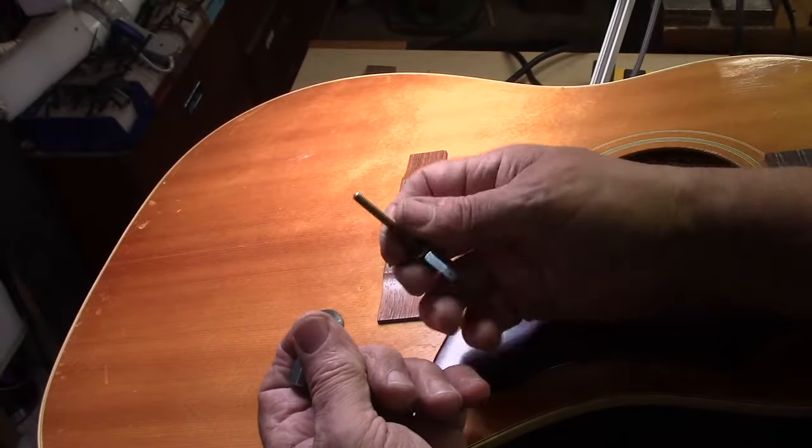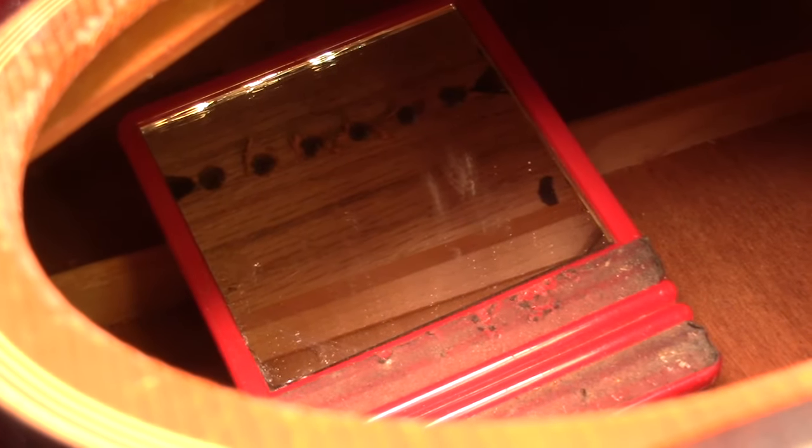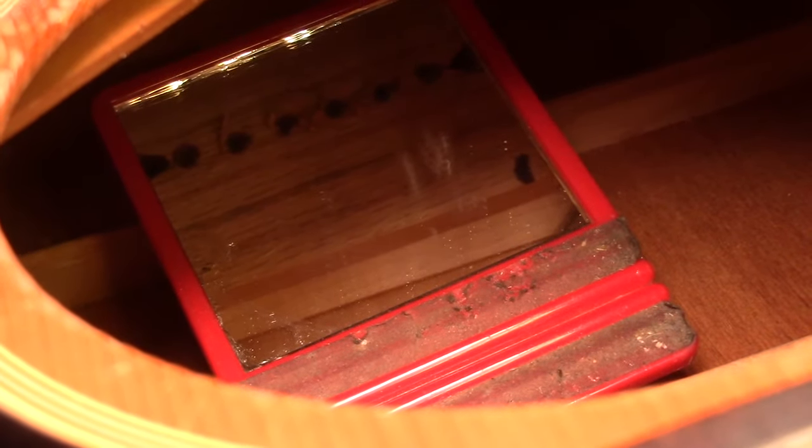So we basically had the same thing on the inside. Now, that big chunk of oak you see is a backer plate for when I through-drilled the new bridge plate. You can see on the exit that the oak was splintered by the drill. That's exactly why I put that in there. So let me take that out and we'll have a look at the bridge plate.